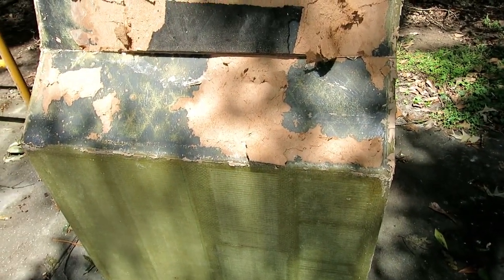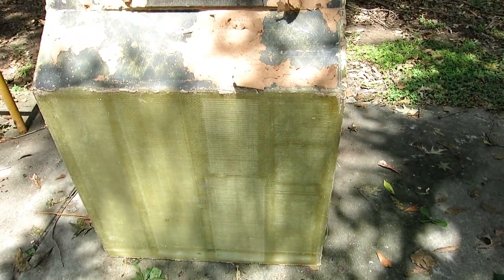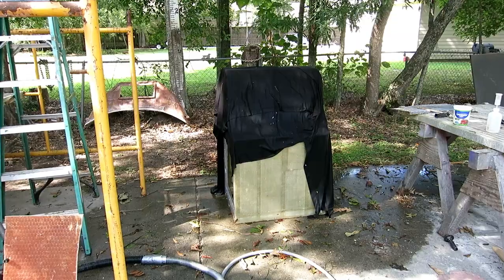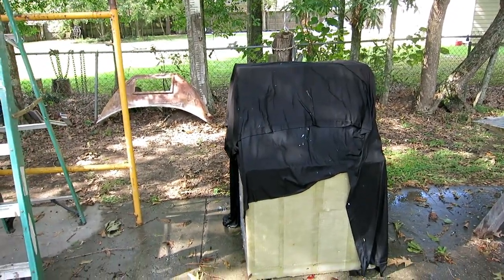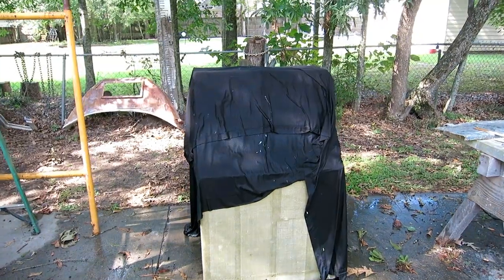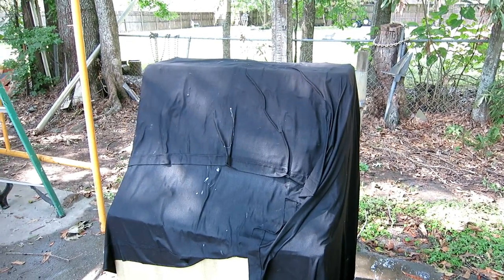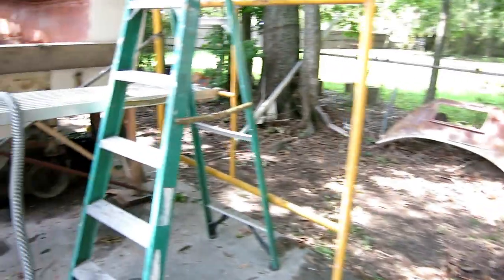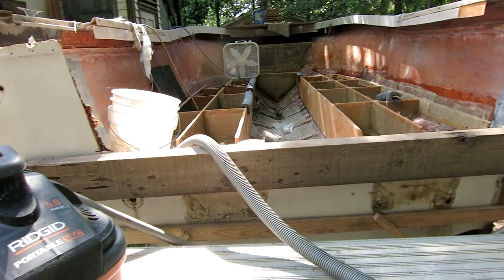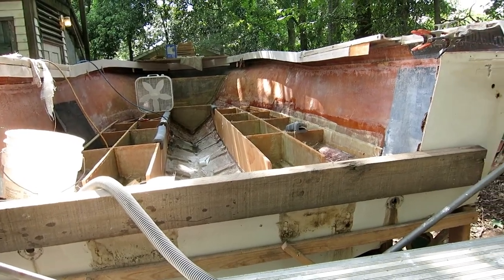After the first piece I started using boiled linseed oil as a separator, and it worked - but it didn't work if panels sat for a couple of days before I applied the poly, because they stuck pretty well. The front piece just popped off - that was just a fluke. Luckily the door jamb side popped right off too, and the last piece came off really easy. I'm doing a number on destroying the mold but that's okay - I only need one console on this boat. The press board will turn into mud with enough water. Here's my console out of the mold and structurally it looks awesome - there's not a problem one. It came out good, it's strong, and now I need to finish it up. I'm running low on resin - I bought 15 gallons and I'm on my last bucket, so I have to go to New Orleans to get some more. Thanks for watching.